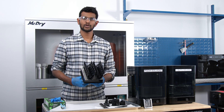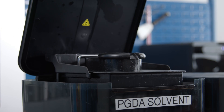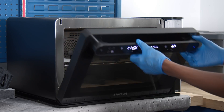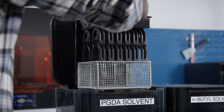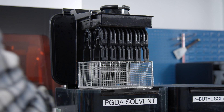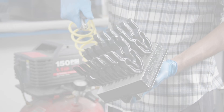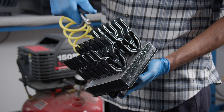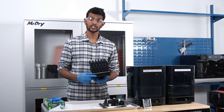After your polyurethane print is finished, there are two simple post-processing steps that deviate from the usual workflow: rinsing your part in PGDA or Propylene Glycol Diacetate, and post-curing in an ANOVA Humidity Chamber. To rinse your part, insert the build platform directly into the Form Wash filled with PGDA. Set the rinse timer to 2 minutes for a thorough automated wash. After the rinse is finished, you can use the compressed air gun to blow the excess solvent off the parts. Check and make sure the parts are clean; if not, rinse and repeat as needed to ensure the parts are clean from excess resin.